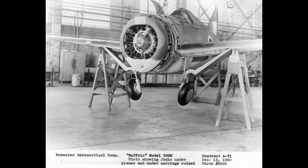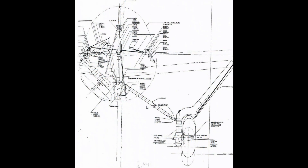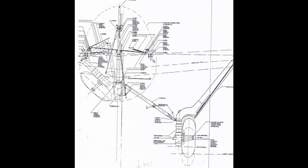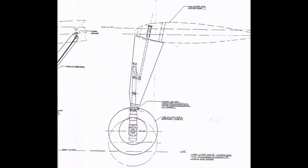When the gears are down, the wheels have zero toe-in, but when the gears are all the way up, they form to the shape of the fuselage. When you start thinking about the mechanism that moves them — some planes had hand cranks, some were electric — this one has a lead screw, a jack screw that actuates parts. I did luck out when I found these drawings because they helped me most, giving me a way to scale the lengths of different struts and what the attachment points may be. Remember some of these views, because when I go to draw it in Fusion 360, I kind of amazed myself how close I got this to the full-scale aircraft.